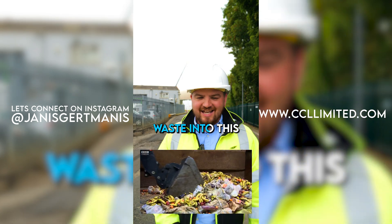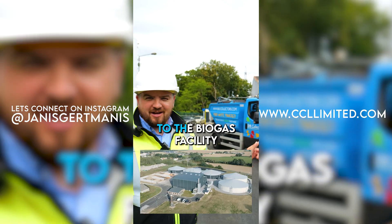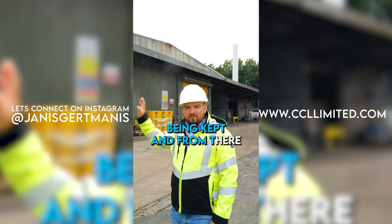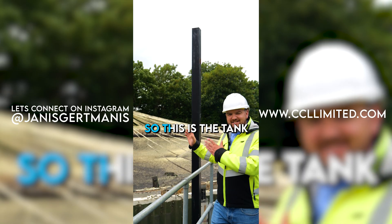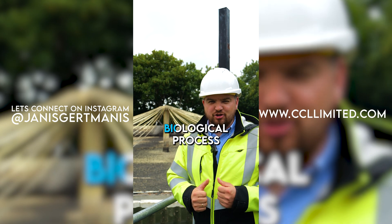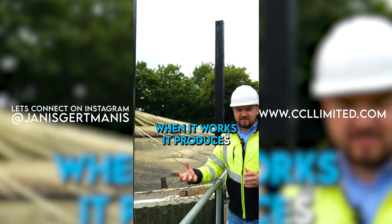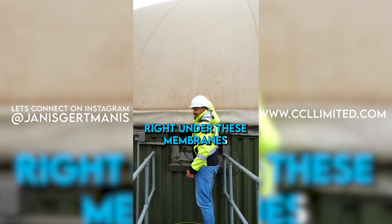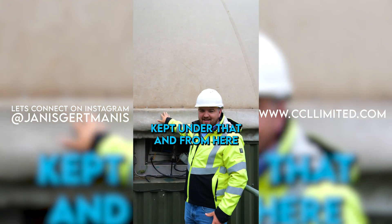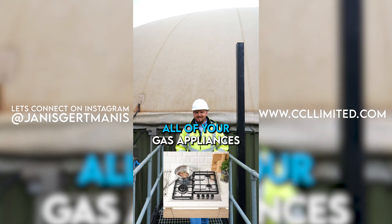Let me show you how we turn food waste into gas. This is how the food waste from your home arrives at the biogas facility. The truck arrives on site and the biological food waste is kept in the storage building, then goes to the tank to start the biological process. The food waste comes in, gets blended together, and is kept at a certain temperature to help the biological process work correctly. That process produces biogas right under these membranes — as you can see on this tank. The gas is kept under there and from here we send it into the national grid, which makes sure you receive that gas at home to run all your gas appliances.